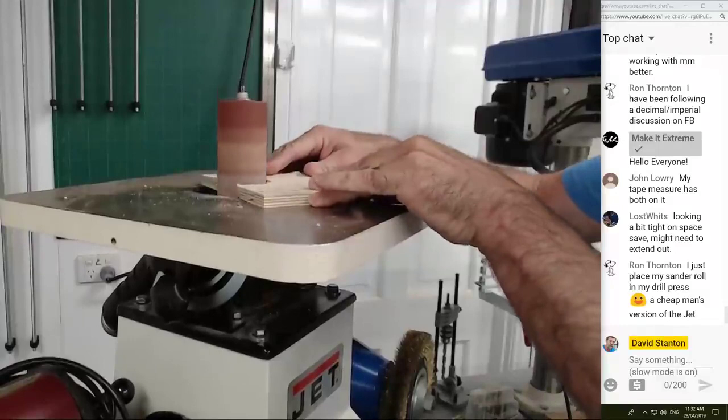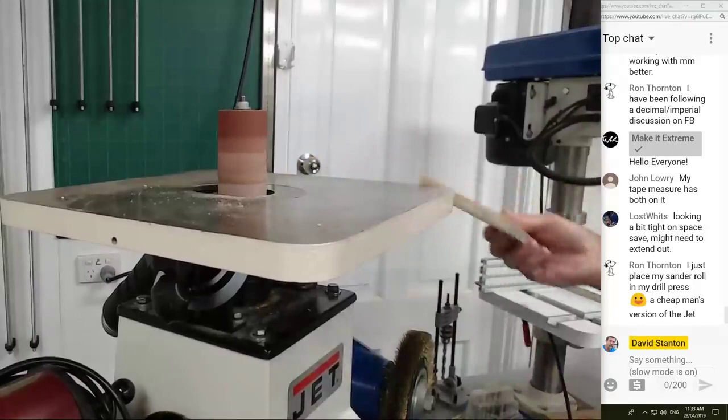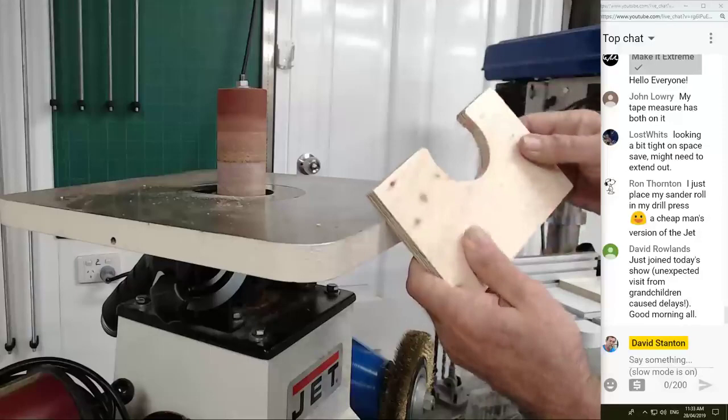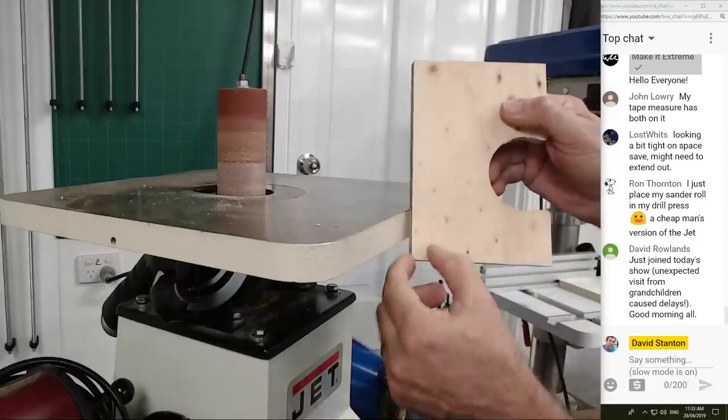Now all the way around on the inside and out the other side. And that's it. I don't really need to do any more. These are basically just to take sharps off. Now we're going to round all of that and we're going to put a rebate down here. Or as you guys in the States would call it, a rabbit. Okay.